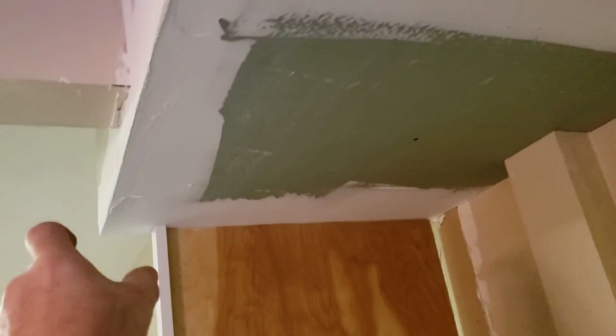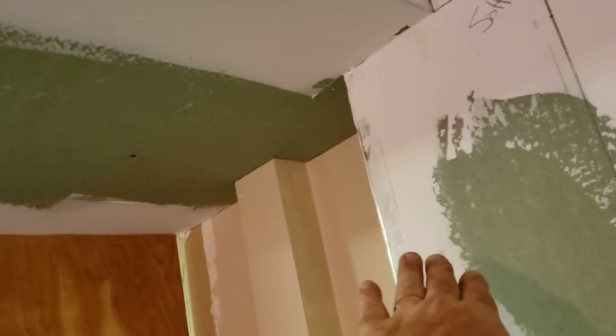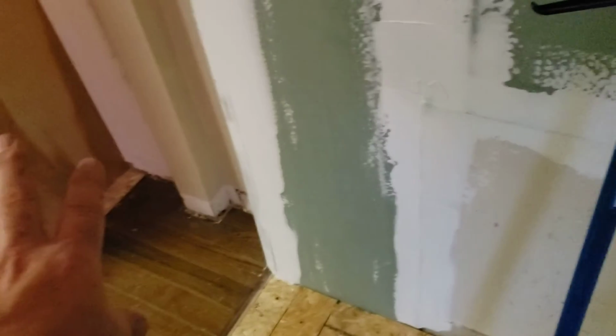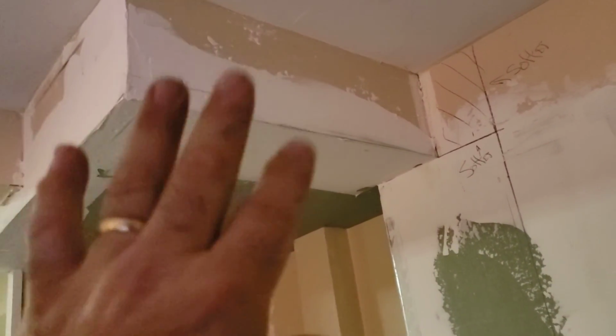Now, when we go to install the refrigerator panel, that panel is 24 inches deep. Of course, the wall's a little out of plumb, but 24 inches deep. This margin across the front of this is where the depth of our refrigerator panel will be on the other one. So this will not be a 24-inch deep panel. It'll be cut to that depth. And then similarly, these are 17-inch deep, I think, cabinets. And they are actually going to be shorter than the panel beside them, but that's because they needed room for the table. Everything else should work out fine, but that soffit box is just a little bit short of being the length we need and the shape we need for the refrigerator section to work out and have a nice symmetrical look to it.